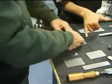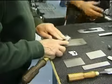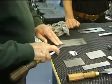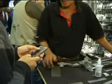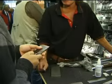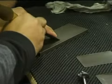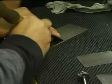And you can see how quickly you're removing. I would suggest that is probably the equivalent to, it's always difficult trying to convert diamond grit size into traditional, but I'd put it round about 7,000. But a lot of people I've got will go from there, if need be, on to at least 10 to 12. Very little pressure. Yeah, you can feel it right the way through.